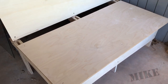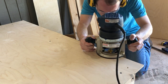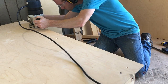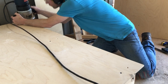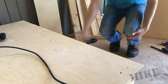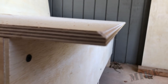Then I routed a 45-degree chamfer, half the depth of my half-inch plywood here, just to ease that edge a little bit. Since everything on this was kind of angular, I thought a 45 chamfer made more sense than a roundover. That's quick work of that. I do wish I had a plunge base at times, or maybe even a trim router, but this is all I've got for now and it works fine. You can see I got a little bit overzealous here and went around that corner on the start, but that's a pretty good chamfer — a little bit of sanding and that'll be great.